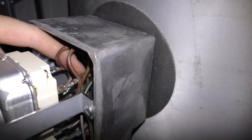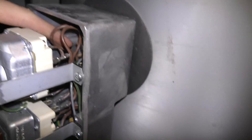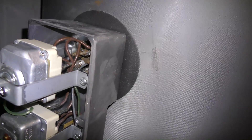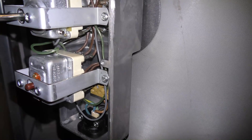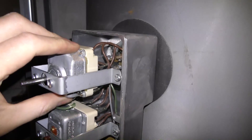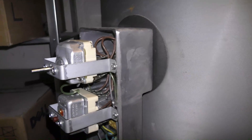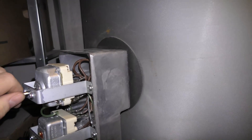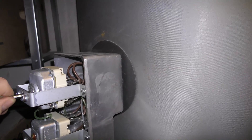You might be able to see the green wire going in there. There is also a gray wire going in there. So there are two sensors that go into the heating element to check the temperature. This one is able to switch off the three phases. Then some connections go up to the thermostat that regulates how hot the water should be. So there are actually two switch-off circuits: this is the emergency switch-off circuit, and this is the everyday 'water is hot enough' switch-off circuit.